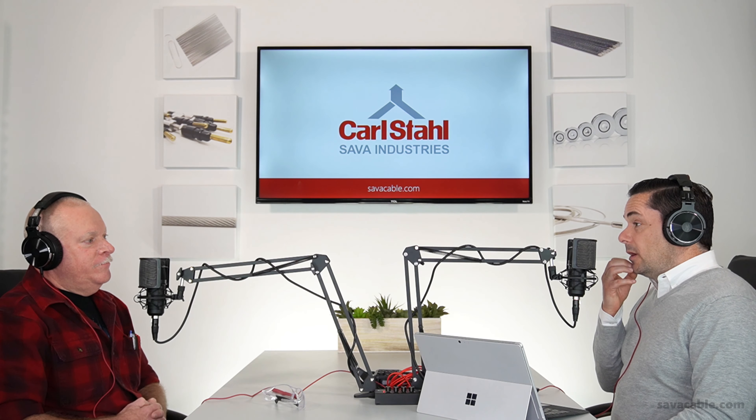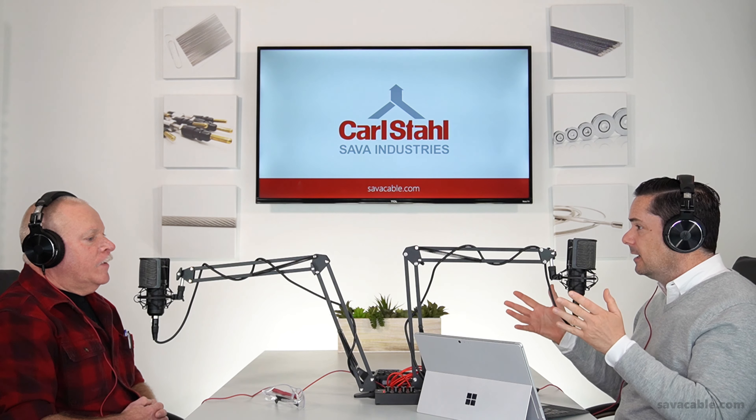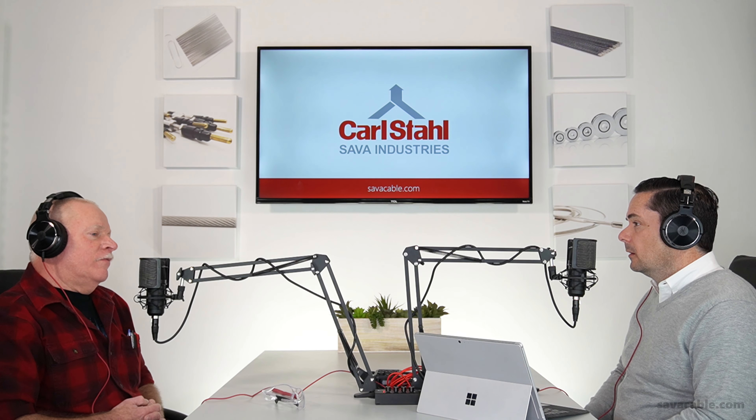So in these larger constructions — 703 wires — you're taking cable you've already made here and putting it into even larger cable, adding more and more strands. Yeah, it's a combination. You would make a basic one-by-seven, and then take that one-by-seven and cover it with 12 additional wires. That particular construction would be a 19-wire construction. Then you'd take that a step further and cover it with 18 additional wires to make that particular strand 37 wires total.